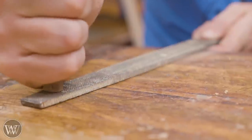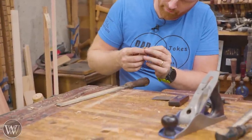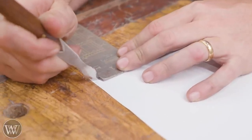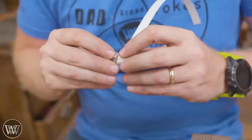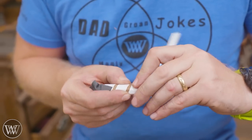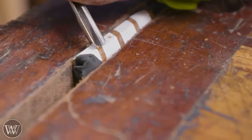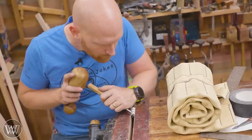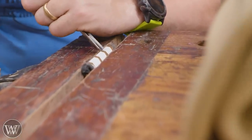Because the grain is so twisted, I find it very easy to bring it over to a file and smooth down the surfaces to get them basically to their finished shape. On the ends, since the tube is slightly smaller than the block, I file down the ends to make it the exact same length as the tube. Now I want to do a little carving, so I cut off a strip of paper about a half inch wide and wrap it around. This gives me a guide that I can chisel along. I have eight sides and each side gets a line crossing at a particular angle — the paper wraps around, taped on either end, giving a perfect spiral line to follow all the way around.